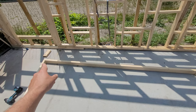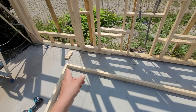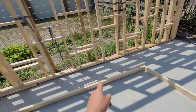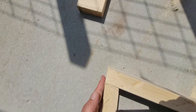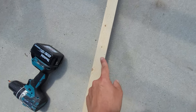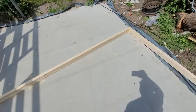I had to cut every beam that will go in the frame. It's a beam, not a pole, the pole is round, I guess. But for every beam, I knew the angle at which to cut it, and I knew the length. When I know the length of the upper side of my side wall, and those are flush, I even cut them flush. As you can see, those are pretty flush. I measured 300 centimeters here, from that corner to the mark over here. That's the 240 centimeter mark on this side. And when both top sides are flush, I know those angles are 90 degrees.